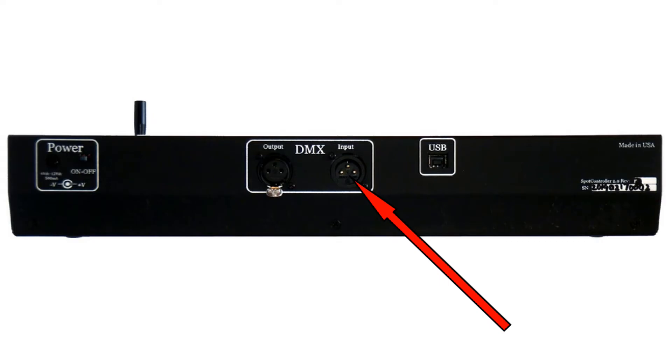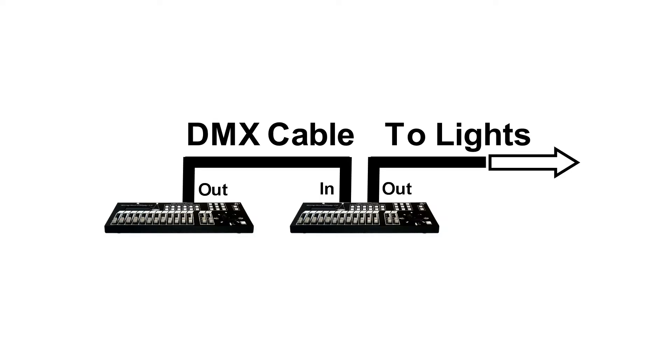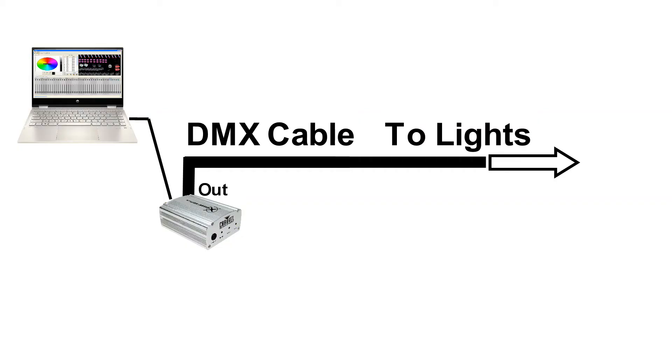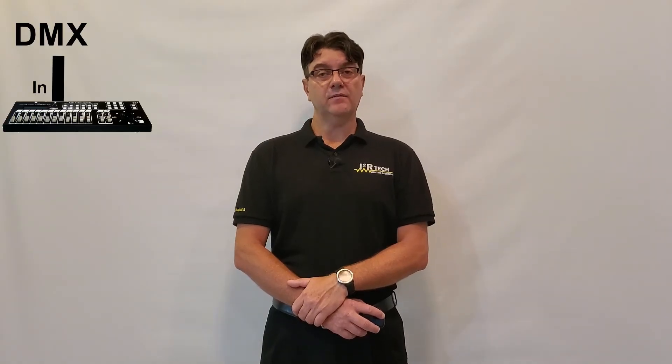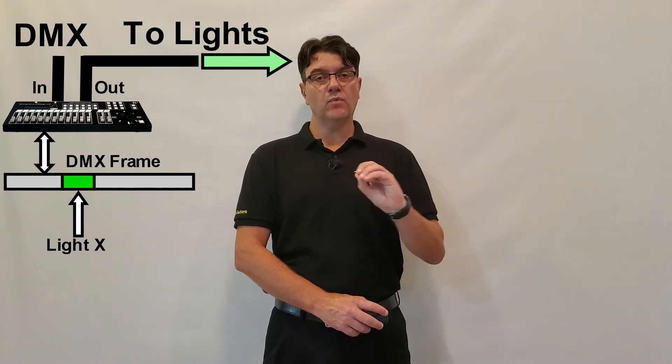Tip and trick number eight. The Moving Head Controller 2.0 comes equipped with a DMX input port. This allows for daisy chaining two or more DMX controllers. For example, you could have two or more moving head controllers if more than one target must be follow spotted at the same time. Or, for a venue that already has multiple DMX lights all set up with their own DMX board or a software-controlled DMX box, the Moving Head Controller 2.0 can be patched in line right after the original controller and before the lights. The Moving Head Controller 2.0 disassembles the incoming DMX stream, integrates its own DMX info in it, repackages the DMX frame, and sends the modified DMX stream back out — meaning it will only take control of the lights it's supposed to, when it's supposed to, and pass through everything else without changing the original programs and shows for any of the lights.